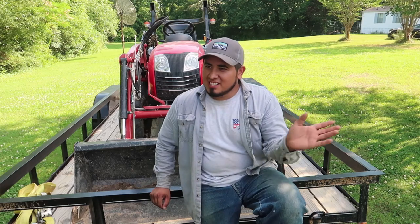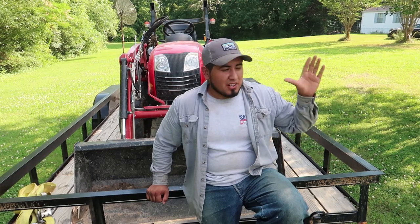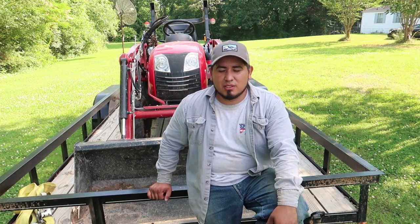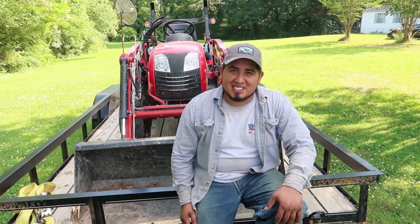There it is guys - another job well done. The customer just drove down with her car, went up and down the driveway, and she really liked it. So we're all done here, loaded up and getting ready to head out. I hope you enjoyed that quick video on how to grade your driveway. Like I said, if you're going to move gravel from the top to the bottom, always keep it around level five. I did have to go down to level three at the top to really move that gravel down, but mainly the rest was level five to four to maintain that nice level ground all the way through. Subscribe to the channel and we'll see you next time.